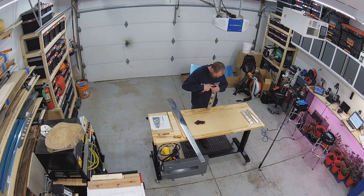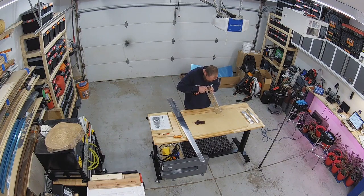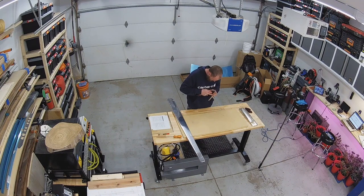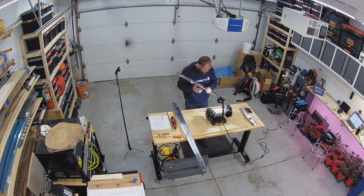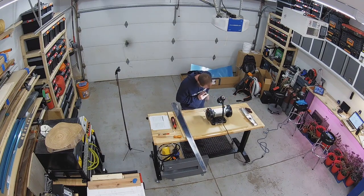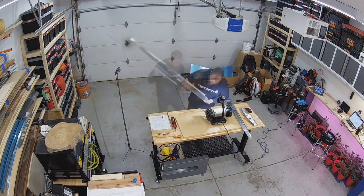Plane Lady is another Vans aircraft builder documenting the process here on YouTube. She's building an RV10 and recently posted a video of a great tip she found on the Vans forums that another builder had shared. The essence is that you take a Scotch-Brite wheel, cut it into pie-shaped pieces, then form them into conical-shaped pieces and attach them to the mandrel on your rotary tool. It looks like it really speeds up the process when working in tight quarters and the nooks and crannies on the ribs and spars. I'll link her video and the original forum post below.